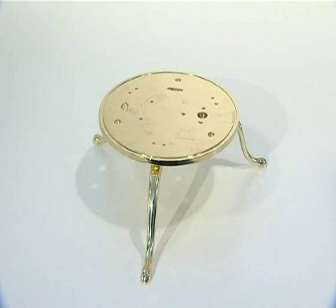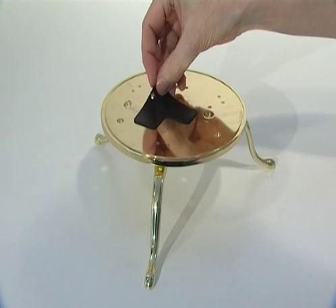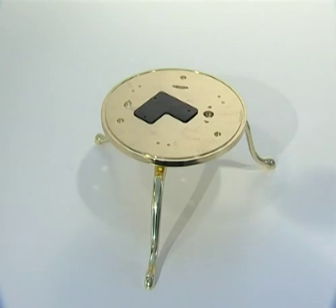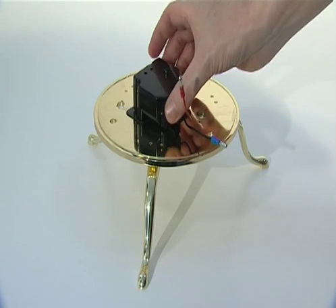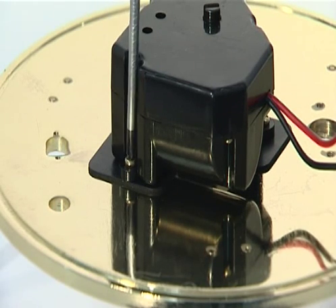The second phase of Stage 6 adds the motor and gearbox supplied with issue 42. Turn the bottom base plate over and stand it on the legs. Lay the rubber pad for the motor's gearbox over the three central screw holes in the bottom base plate. Lay the gearbox on the rubber pad and align the three fixing holes. Fix the gearbox securely using three PM3 screws.